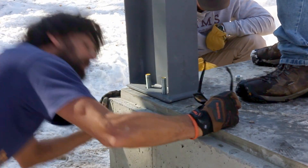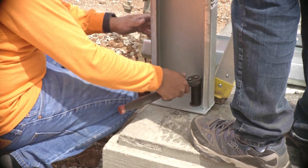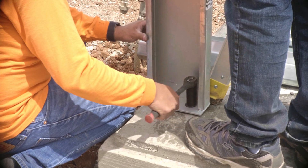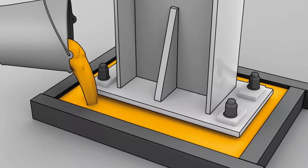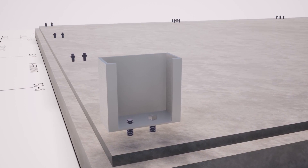If we're out of tolerance we need to shim all of the low columns up to the high ones. Up to a half inch is acceptable. If you need more than that, give us a call — grouting may be necessary or something else. Don't worry, grouting is typical on construction projects like these, but you should reach out so we can go over it with you and maybe get engineering involved if it's something way out of tolerance. The biggest concern with raising columns more than a half inch or so is that we may not have enough bolts sticking through the base plate for the nut to grab onto.